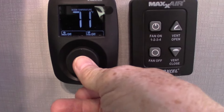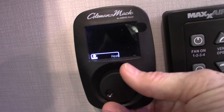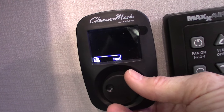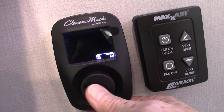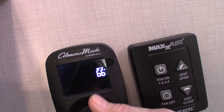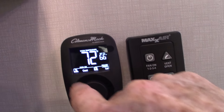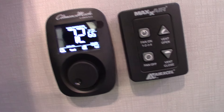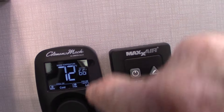This is your thermostat — it's a new model. You push it to get to mode. Mode is off right now, but you can cycle through: cool is the air conditioner, the next is the furnace, and then there's a combo mode. Let's go to air conditioning — cool, auto low fan. Push it again and it's all set. Now you can set the temperature — let's say 66 degrees. Any time you're setting it, push it, pick your mode, click it. With the propane furnace, fan speed is not adjustable, but you can still push it and set the temperature.